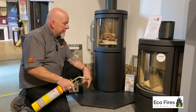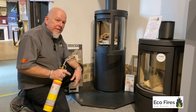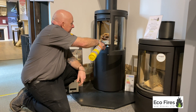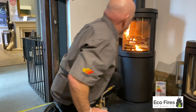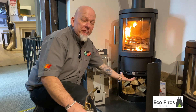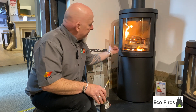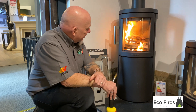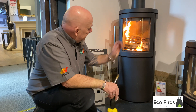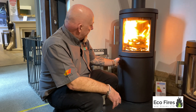With my trusty blowtorch in hand, I thought I might as well light this and show you how this one looks when it's going. There you go — I just lit that very quickly. The control is set midway, but like I say you don't really need to touch that. Once you know how your stove runs you probably won't need to touch it again. Just leave the door slightly ajar for a couple of seconds to let the fire get established. Shut the door again and it's going to do its thing. That's been lit for about five minutes now, flames are nice and established, control is set halfway — don't need to touch that again.